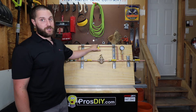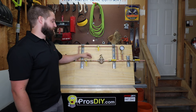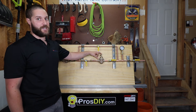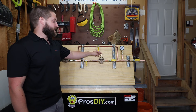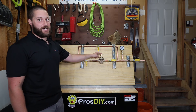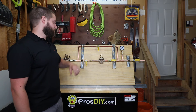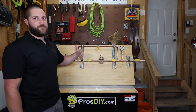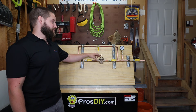We go over here to our bypass, which would be in the closed position, and it goes over to a pressure reducing valve. This one does have a union so we can replace it if we have to. This is currently set for 15 psi but we actually have to have 18 psi at the building we're at, and I'll show you how to increase or reduce pressure on this.